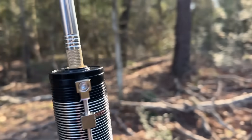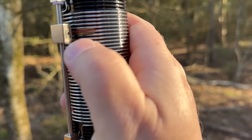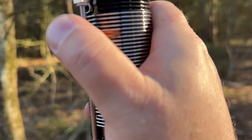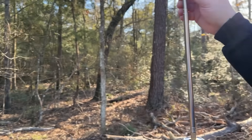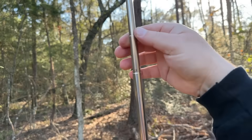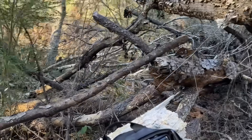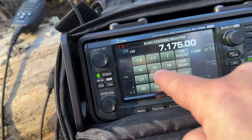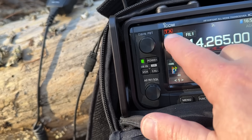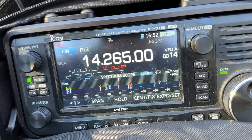For 20, we'll slide this up. Today, for the ground conductivity, that's the mark for 20 right there — I'm going to go one tap below that. Make sure it's riding on there, then extend the whip to my 20 meter mark. Let's go back to the radio. Go to 20 — look at all those signals. Key up. Look at that: 1.3 maybe. Just like that. Let's do 17.